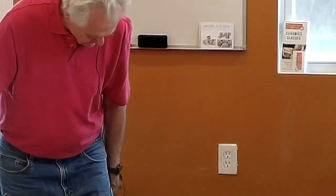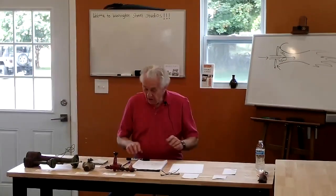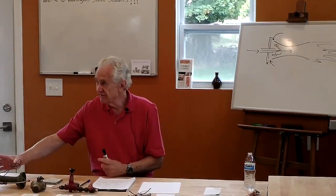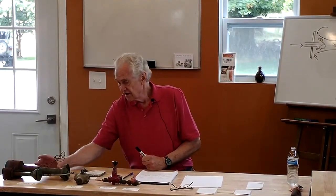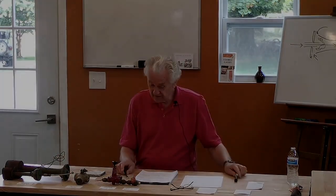So the nice thing about a Venturi burner is it's bringing in at least, not all, but part of the air that it needs to burn, and right in the burner, the gas and the air are mixing before it even gets into the kiln. Normally you wouldn't have the burner sticking into the kiln, you'd have it on the outside. So you have some gas and air mixing before it even gets into the kiln, which is an advantage.